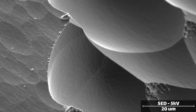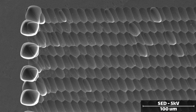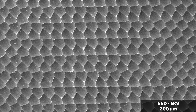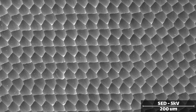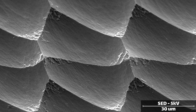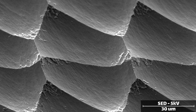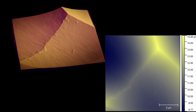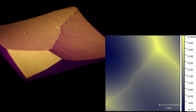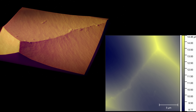Because they etched so deeply, we're essentially seeing only the very bottoms of the spherical ablation marks, so there's a lot of heavy overlap between all the pulse strikes. Due to misalignments in the laser system, astigmatism, or the sample not being perfectly planar, there's kind of an oblong or oval aspect to all the laser marks, which gives you a more triangular or hexagonal structure. Under the AFM, the surface is super smooth with a pretty sharp peak between all the different spots, which was cool to see — it maintains a fairly crisp line between each pulse spot.